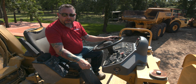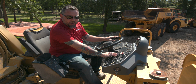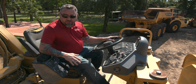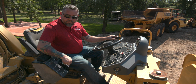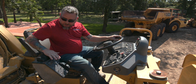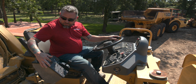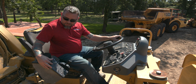So here, this is the procedure for actually moving the machine. We're going to disengage our parking brake. Over on the right side console, this is our propulsion handle. We're going to move either forward or reverse depending on which direction you want to go, using our directional button. To increase and decrease how fast we move, we increase and decrease the potentiometer here, the movement control. On your right side are your steering levers for which direction you want your tires to face.